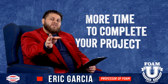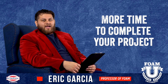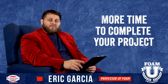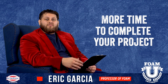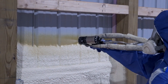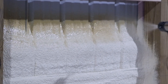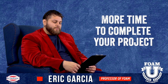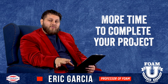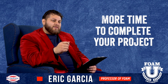Next thing we want to talk about is how does this affect you as the customer? If you choose to have closed cell done in the colder season on something like metal, you have to expect that the job itself will take much longer. It's going to take longer to prep the job and longer to simply spray the job. A lot of times in these situations, it takes multiple passes to get the depth of foam that you need. Sometimes you have to do a flash coating just to get foam to stick to the surface — essentially warming up the surface with the foam — and that takes a lot of time. This adds a lot of time and material for the contractor, which can obviously add a lot of cost. As a customer, you want to be prepared for that.